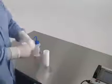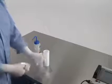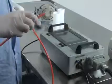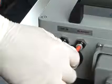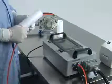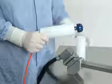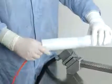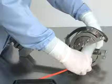Once your pipe is cut and faced, it's important to clean the two ends with isopropyl alcohol at a concentration of 90% or better. The inflatable support bladder line is connected to the SIB3 side port and then fed through the pipe to the point where the weld will be made and connected to the bladder with the push-to-connect fitting. The bladder is then centered at the junction of the pipe. The assembly is placed in the middle of the weld head and locked in place.